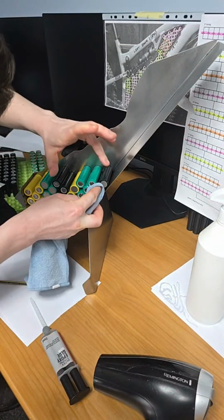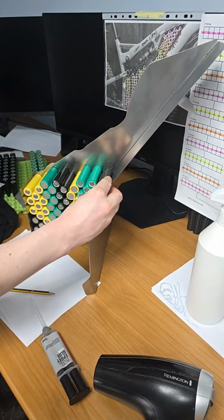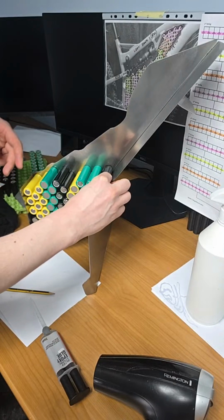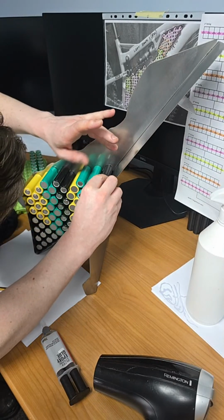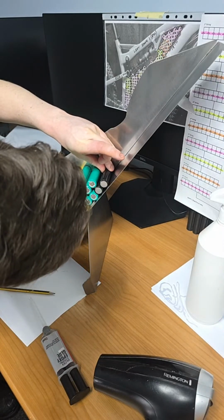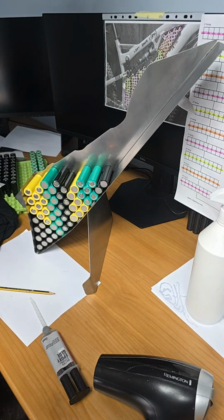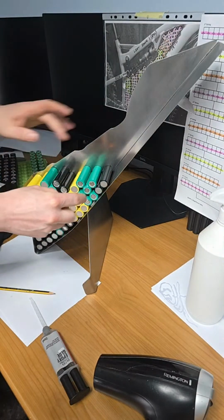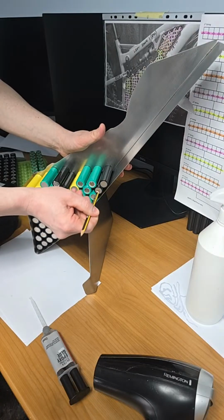So as I go here, I just like to clean the cell. We want the glue nice and neat with a nice wee bead, and I'm just going to turn it down. Remember, black corresponds to purple here. Turn it down into the cell underneath it until we see that bead looking like it was just placed on with the applicator. So it looks concave, and that's perfect. So we'll sail underneath it, just give it a wee tap in, and this one as we go.